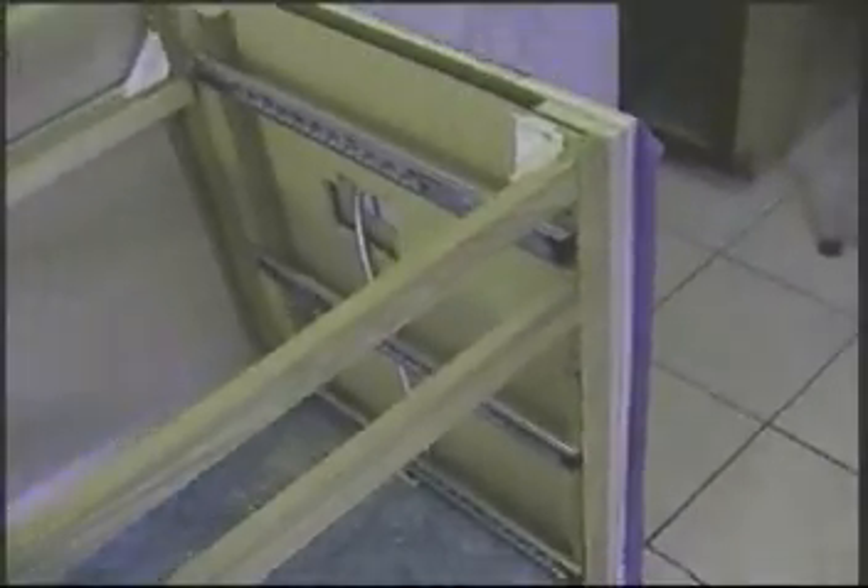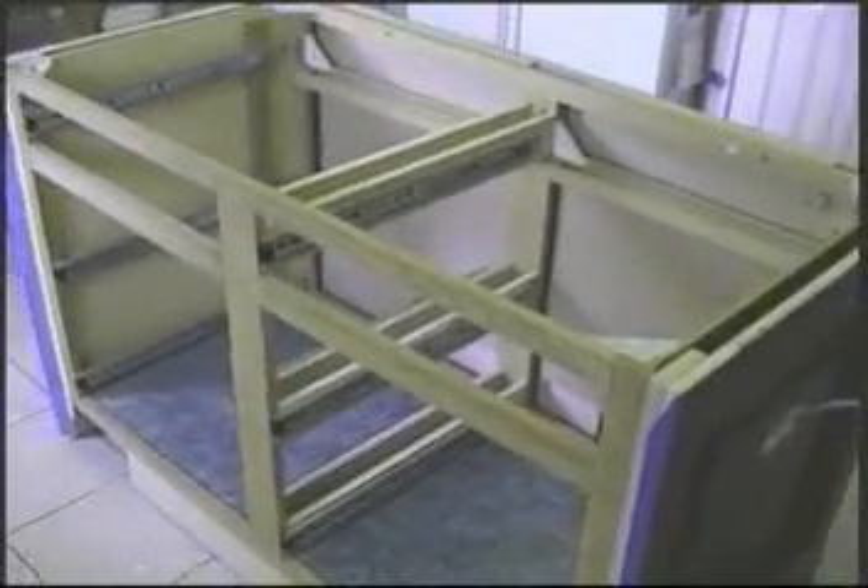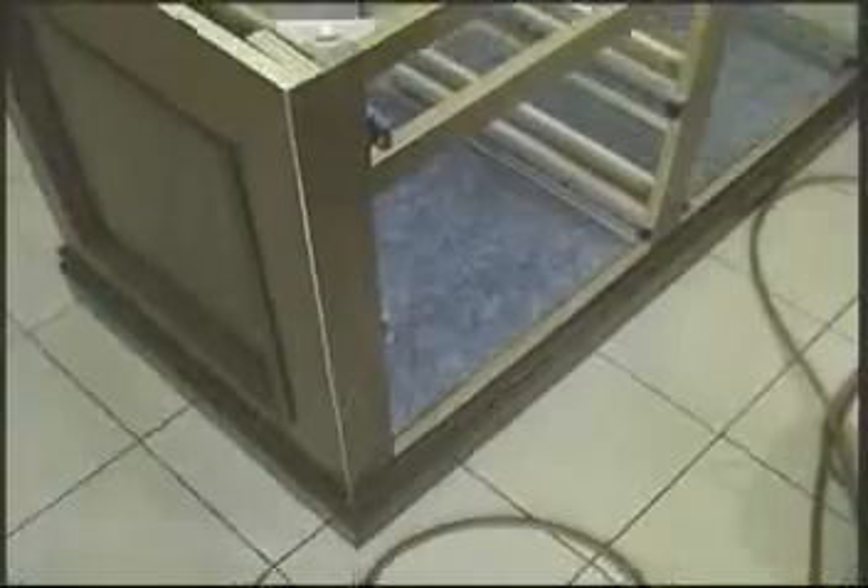This is the island cabinet we made a sleeve for. The sleeve has some wainscote panels on the sides and in the back, and it flushes off the front of the cabinet. We need to veneer over the edge of the sleeve and the face of the far right and far left stile so it looks like one cabinet. All the drawer slides are attached — the full-extension ball-bearing slides for the pull-out shelves and the drawers. We'll be adding a five-inch base molding to the bottom of the cabinet to make it look more like furniture.